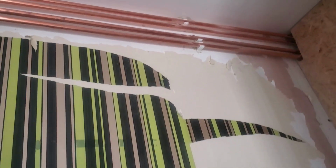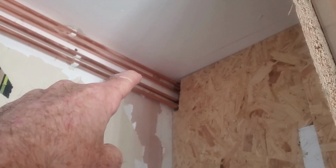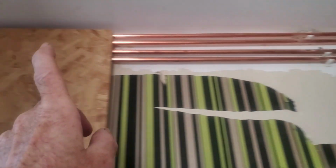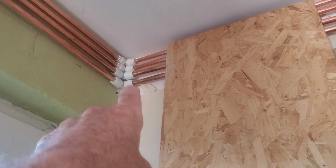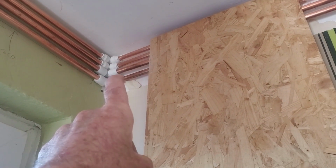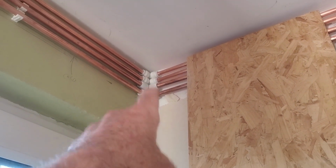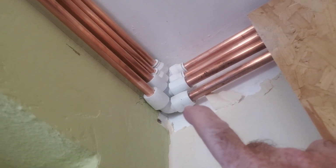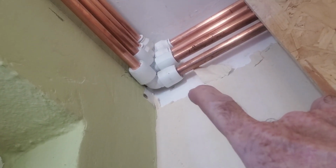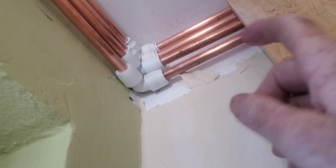I made a slight mistake putting in the central heating pipes because there was a batten of wood going across there. The pipes went down slightly downhill, but that means I would have had air gathering up because of the thickness of the connectors. If that was soldered, they came a lot closer together. Because of the compression fitting connectors, you got a bigger space. The connectors I used, the local plumbers had, and it's about £20 for 10 of them, and you need a special key to release them. And there's some places you can't get the key in, depending where you have them.